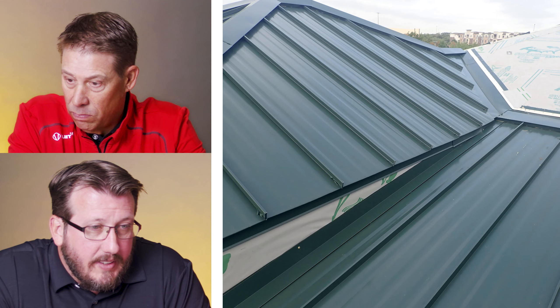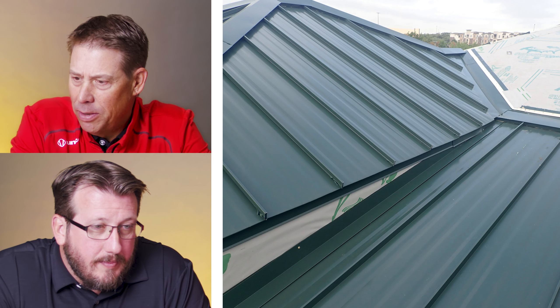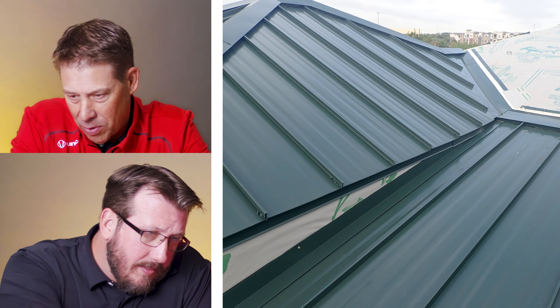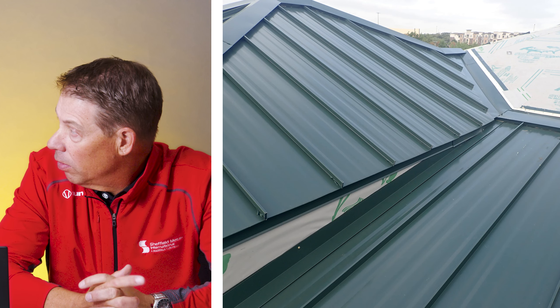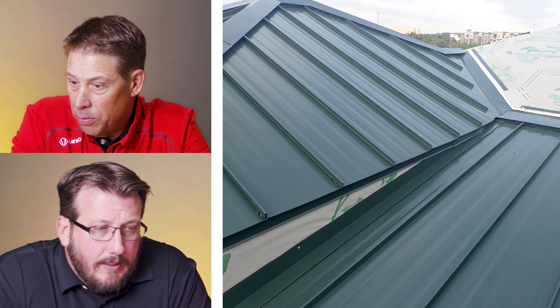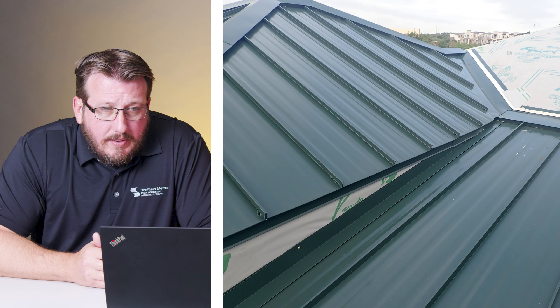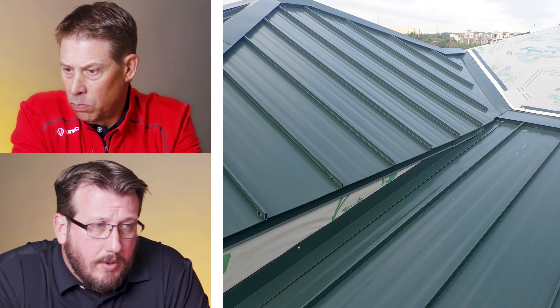We do it nice because we do it twice. Is that the same job? Day two. This one doesn't look that bad, but the devil's in the details. What is going on at the eaves? Looks like somebody got a little crazy with the sealant when they tried to do the up-and-over seam sealant for the snap locks. Sometimes less is more — it's definitely cleaner. They're gonna need some finisher counter flashing on the sidewall. They're using a transition flashing; looks like they got that screwed off correctly, gonna go back and strip it in. It's half-completed work.